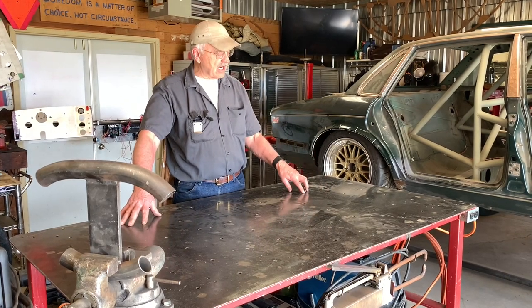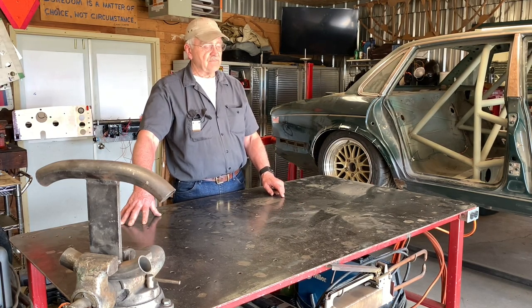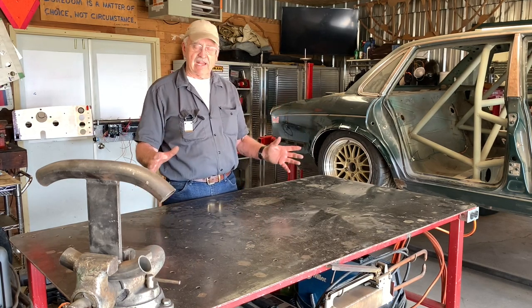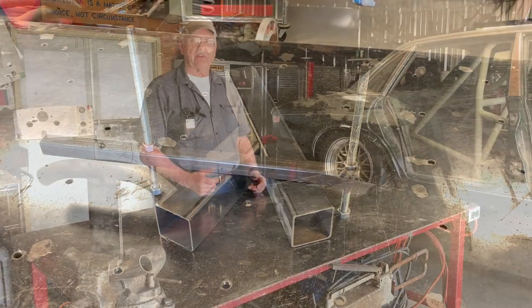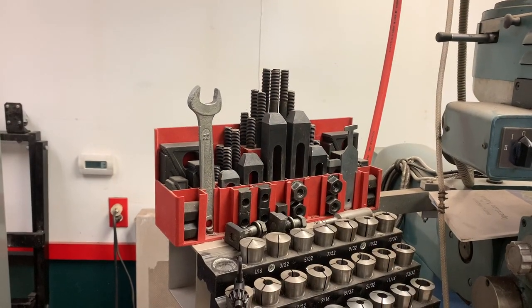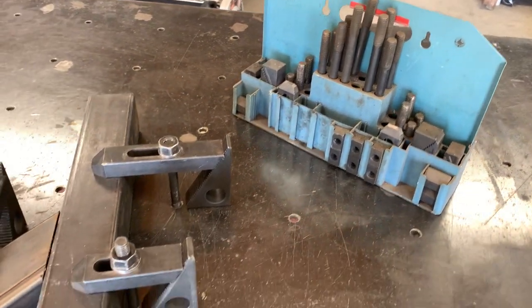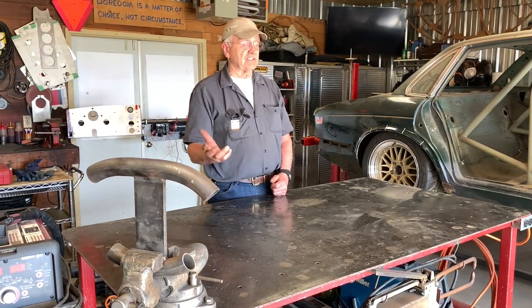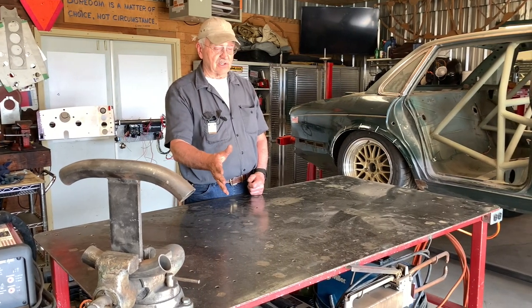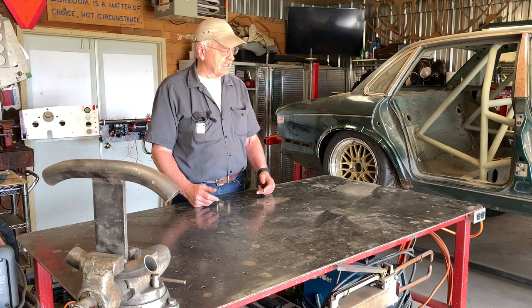If we look at the top more closely, there are holes drilled six inches on six inches, drilled and tapped to half-inch by 13 thread. When you're welding material, you really need to clamp it down to something solid. I've got pieces of square tube with holes drilled in them and threaded rod to lock things down. Also, the hold-downs you'd use on a milling machine have a half-inch by 13 thread — I use those quite a bit. In fact, the rotisserie was the first large thing I built on this bench, and those proved invaluable.